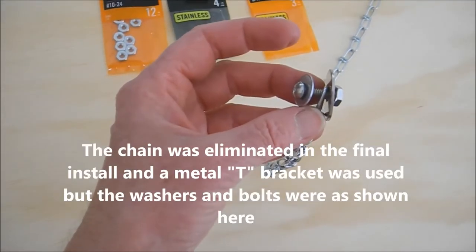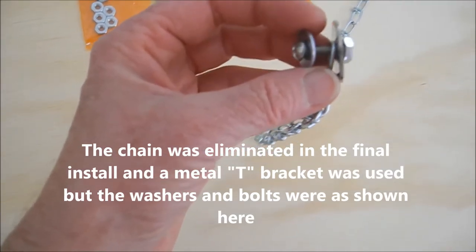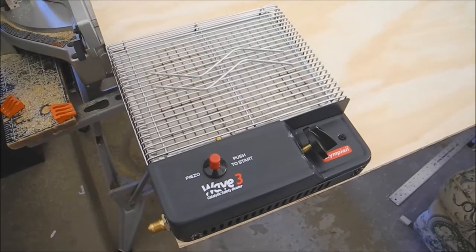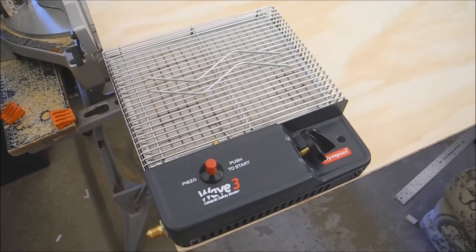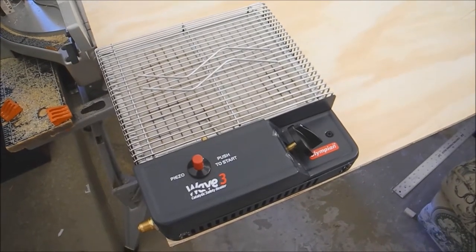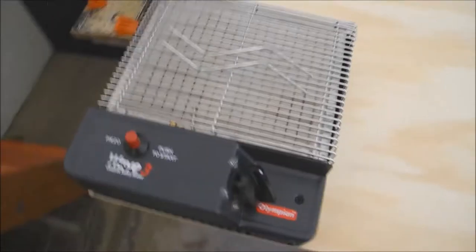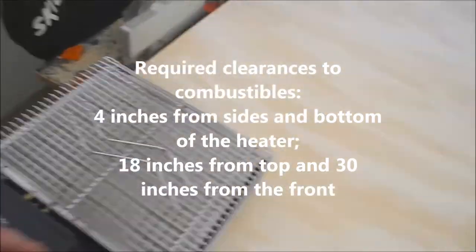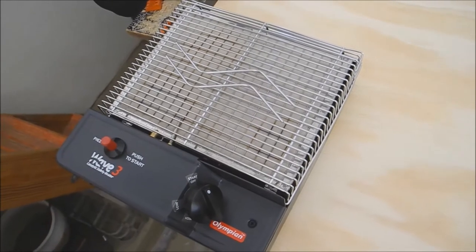This is my dry run. I'm going to first stick the bolt in the hole in the back of the heater, then on the outside of that I'll have this smaller washer, then the wood, then the chain, then the big washer, and then a nut tightened down. Here are the parts I used. Next, you measure the plywood that goes in the back — I'm using 3/8 inch plywood because I want to add some more wood in one spot. The wall is not going to be flat behind this, so I have to add something to push it out. I'm tracing exactly the same size as the heater because you need room to swivel the elbow for the gas line. They also say they don't want any combustible materials within a certain distance of the sides, front, top, and bottom — just the back is okay for combustible materials. So I'll just keep the plywood the same size as the heater.